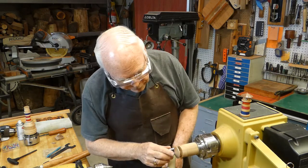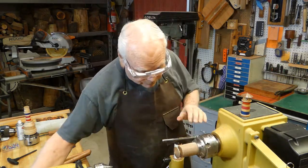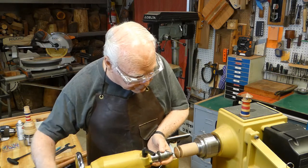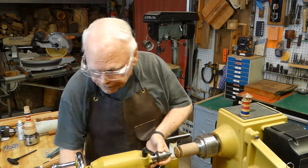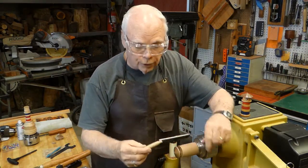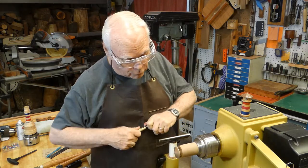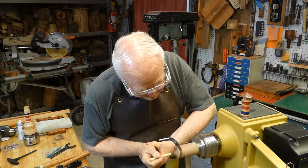First, before I sand, I've got a point here, and that's going to be a little hard to center a drill on to get it drilled out. So my solution to that is to turn the lathe on, bring up a live center and just barely touch it, which will put a little dimple in there. Now I can take my homemade drill bit. You can see the drill bit itself is real small. I just glued it in a piece of wood, turned it down so that a pen cap would fit over it to protect it. And now I can just run this in.